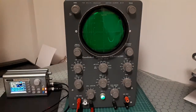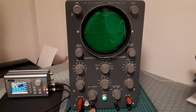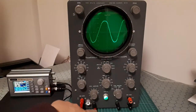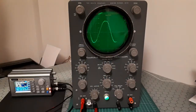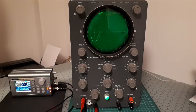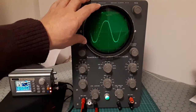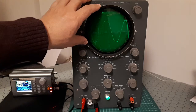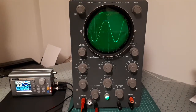What we're seeing here is a signal that comes from the oscilloscope — that is one volt. This is just one volt coming from here: a sinusoidal signal shown on screen. This flickering that you have is due to the fact that these screens do not have special persistence.